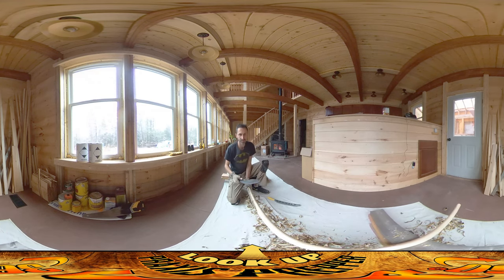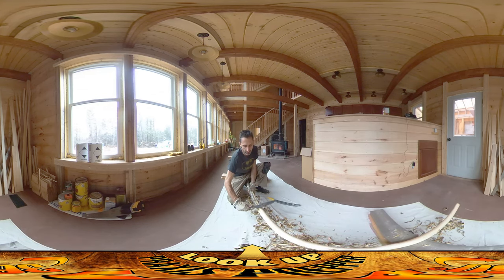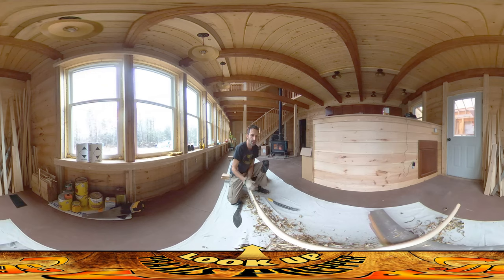I'm just going along it like this. The handrails need to be between an inch and a half and two inches by code, and this end is just a tiny bit over an inch and a half while it's probably over two inches at the other end. So as I go down, here I'm just pretty much trying to get the bark off, and when I get to the other end I'll be going into the wood a little bit to narrow it down. After this I'll go through with the rasp to smooth out all the little knots and different areas.